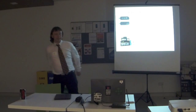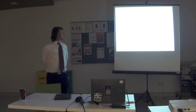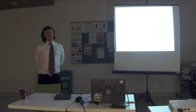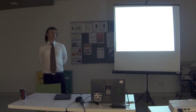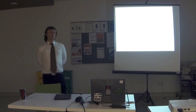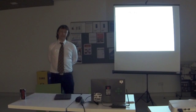So basically, if you look at the components, it's bidirectional. You have an antenna, you have, in two directions, filters, then you can down convert the frequency from the desired one to an intermediate frequency. And after that, you can sample the signal at 20 megasamples per second. So basically, let's try it with 20 megahertz of the spectrum. So you pick 20 megahertz out of this whole range, and there is a lot of things there.